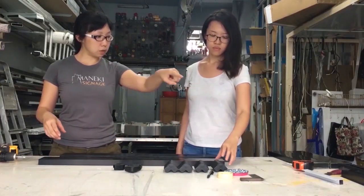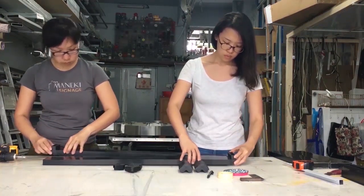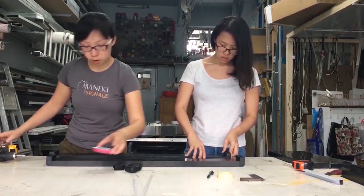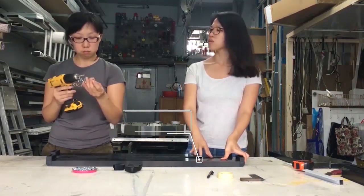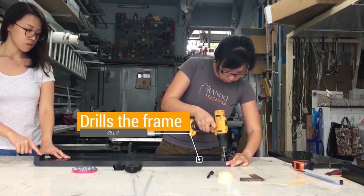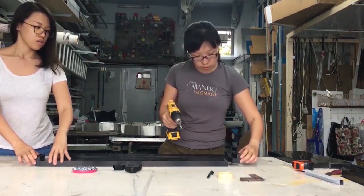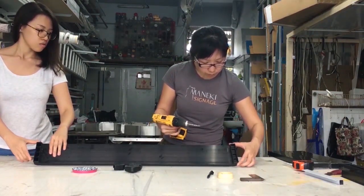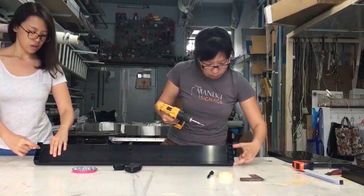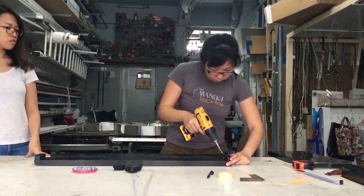The next step now, we're going to assemble the box. So we start by putting in the rubber socket. Then we use the screw. This one is, I think, what they call the self-screwing screw. I have to hold in the socket and then drill it here, to make sure that about half an inch will go inside. So we have to drill somewhere here, not too far out. The purpose is to secure the socket and to align to the tree division.